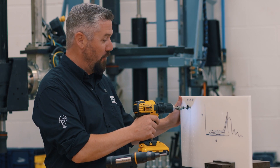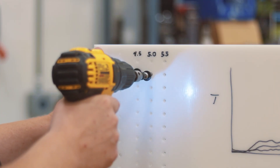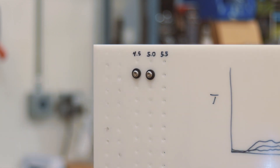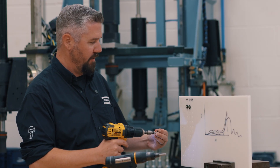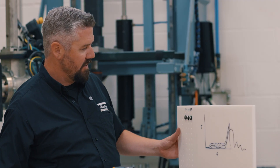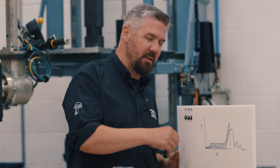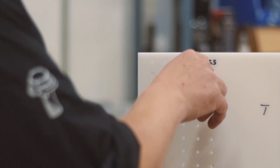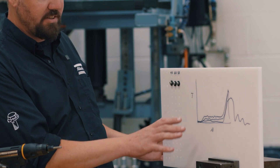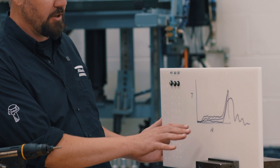All right, that was the 4.5mm diameter hole. Here's the 5.0mm hole. And let's see the 5.5mm. Whoa — we don't have enough thread engagement into the plastic and this actually strips out the hole. Looking back at our trace here, I made a pretty good prediction about what was going to happen.